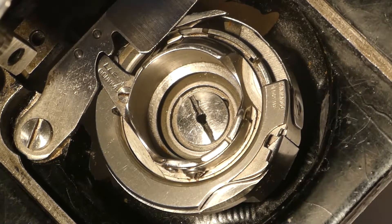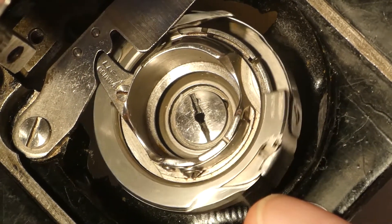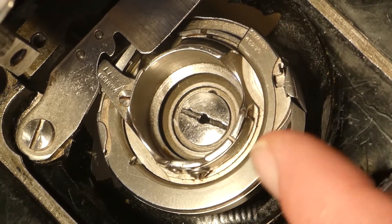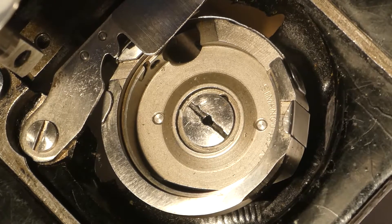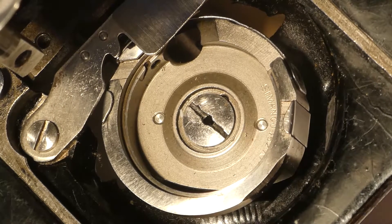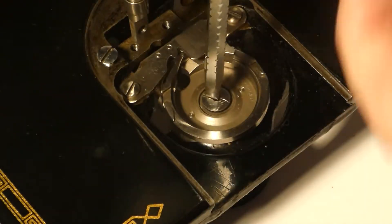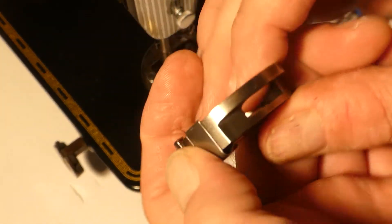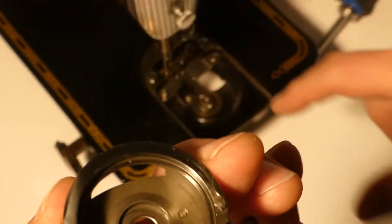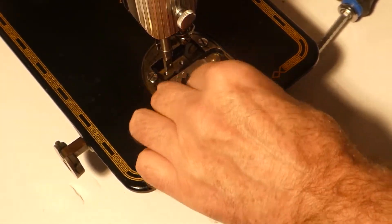Now what am I trying to do? I'm trying to get it off without knocking the camera over. I push the spring out. What I need to do is hang on to the hand wheel so that it can't move, and then I have to push right here like this. I don't know why I'm so clumsy, but it always flies out. But that's okay — at least it comes out. Let's take a look at the hook while we're here. So once again, I'll hold the hand wheel. There, that's snapped loose. There's our screw, and there is the hook. There's the base, a couple of screws here — we're not going in there. There's a cutout there to line it up on the little axle there like this, so you can't put it on wrong.